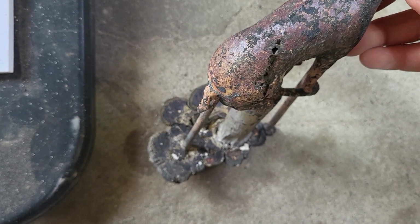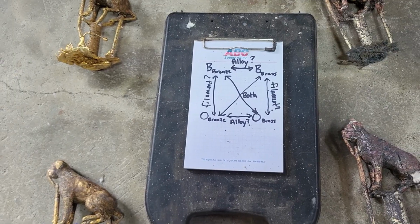So pretty disappointing. My tests worked out pretty good. I got a lot of information from that, such as a confirmation that brass is a better casting alloy, and a confirmation that using the Overture filament is better as well. Now, these were 2 wall prints with 0% infill, so I think that's why there was a higher chance of it filling up with the plaster. And that's why the 4th one failed. I think if that didn't happen, the 4th one would have been perfect.